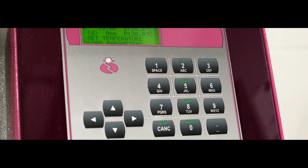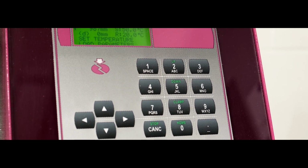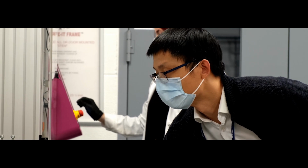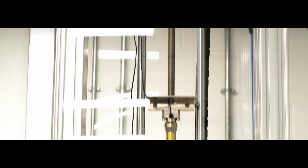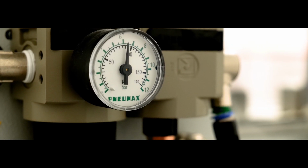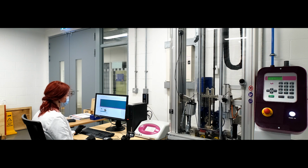The control box is attached to the right side of the turret and is provided with the remote operation mode, including power on, emergency buttons and LCD display. Impacting of the specimen can be controlled by the control box. CEAST VIEW software is used to display and analyze recorded data, which is transmitted via a data acquisition system. This impact tester will record the load and deflection during the impact event. These data are essential to understand the impact resistance or impact damage of the specimen.